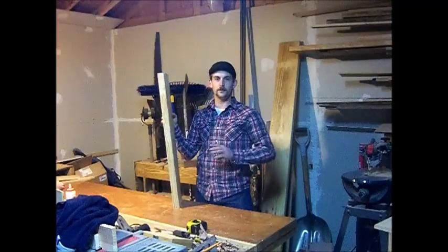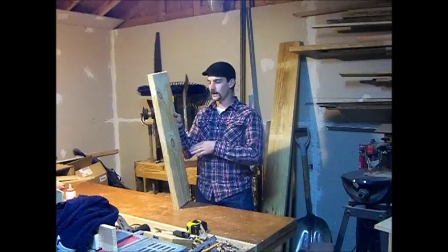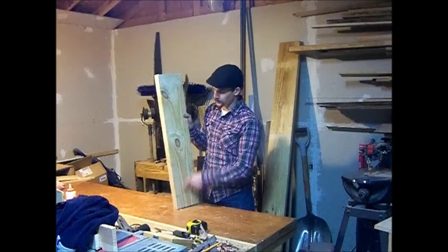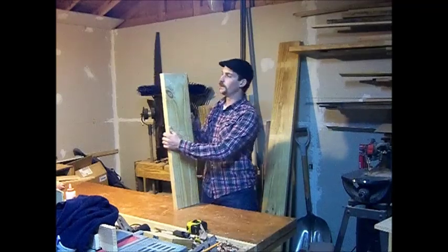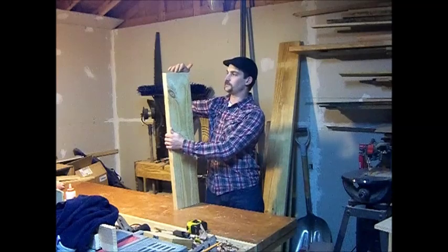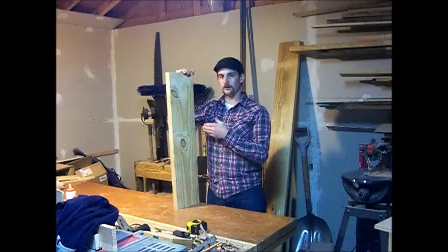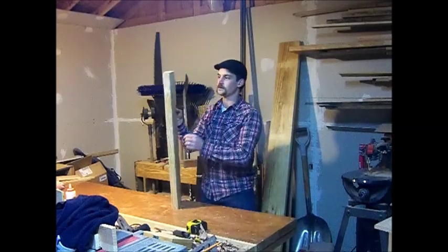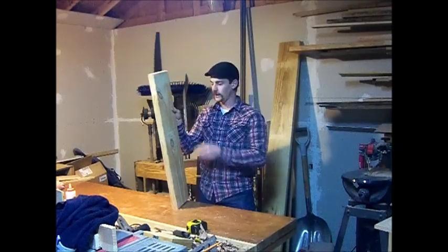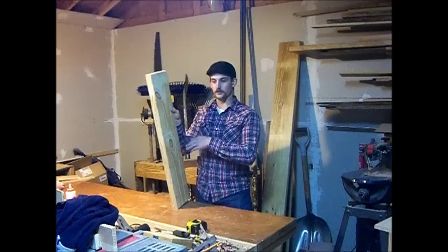Now that I've gotten all my main parts — the little stretchers for the seats and the legs — I've gotten the back leg marked out with the 19 inches height, and then the top of the back of the seat will be 33 inches tall. It's going to be like a lower back area, and what I'm going to do is just kind of rough out a hand sketch for the design, trying to get the flow correct.